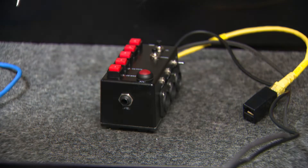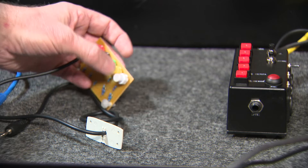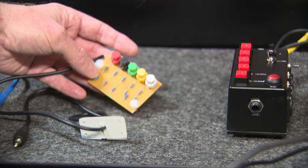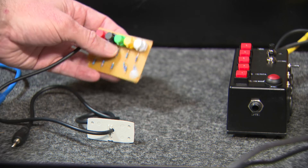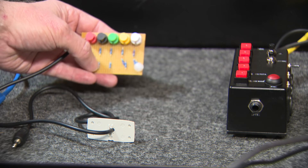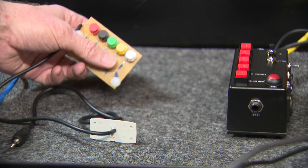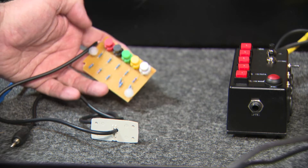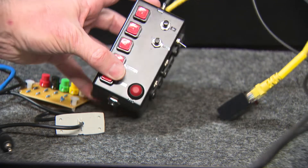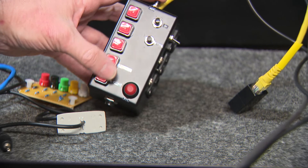I experimented with a colorful keypad-style remote with buttons one to five. You have to get the right resistor value to trigger each memory — in some cases you need two or sometimes up to four resistors depending on what you have. The values are not standard values so you do have to play around. Each resistor value simply triggers a different memory.